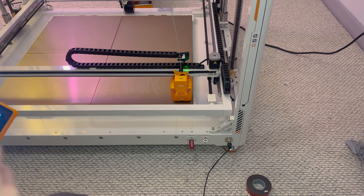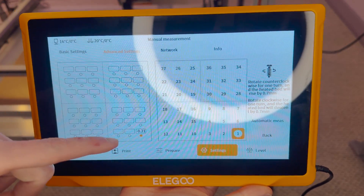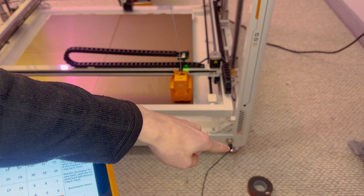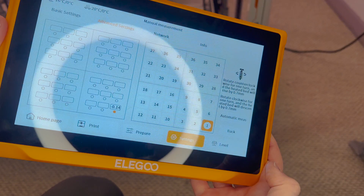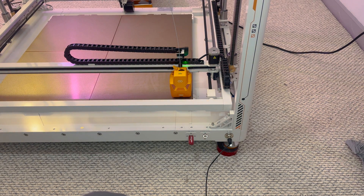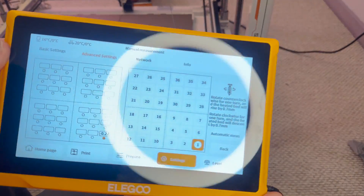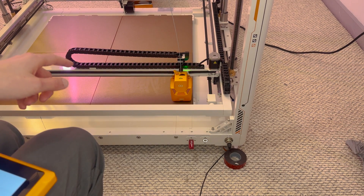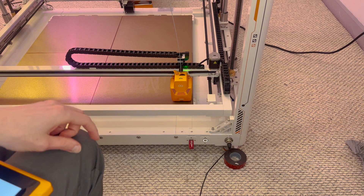Let's do an experiment. I've moved the printhead to the bottom right-hand corner of the 3D printer and entered the advanced bed leveling feature, which lets us precisely measure the height of the bed at certain points. Right now we're sitting at negative 0.21 millimeters. Let's see what happens when I put a roll of tape underneath the foot of the 3D printer. We've now gone up to negative 0.14. Taking the tape back out, we're pretty much back to where we were. So if you ever move your 3D printer, you'd have to re-level it every single time. I've heard about putting the printer on casters, but keep in mind, if your floor is not even, moving the printer around will warp the build plate.